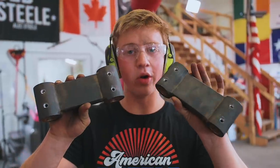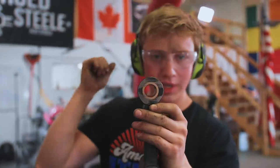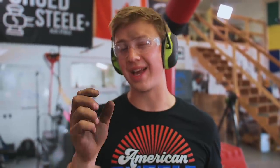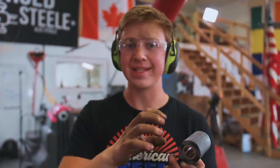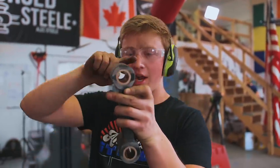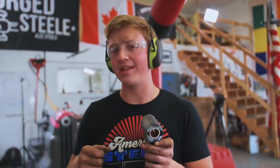So we've got our oil holes drilled, but now the oil can get in there, it needs a place to sit inside. So we're gonna take the die grinder in the grinding room and carve some oil grooves, which act as a kind of a tiny reservoir inside the bearing to lubricate the shaft as it spins around. So we're just gonna take a die grinder bit, carve ourselves some swoop-de-doop-de-whoop-dees in there for oil to sit in.